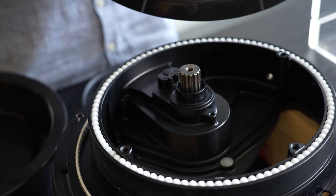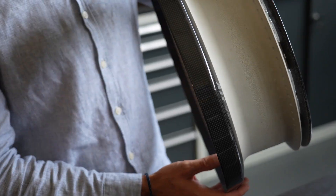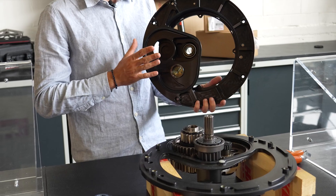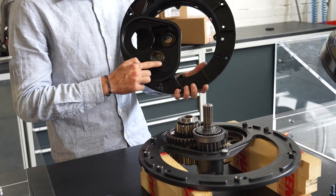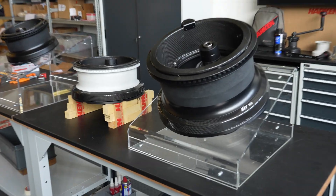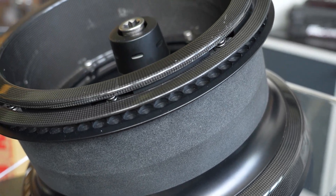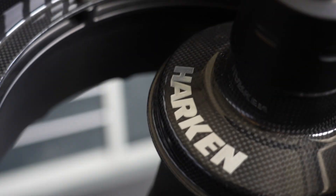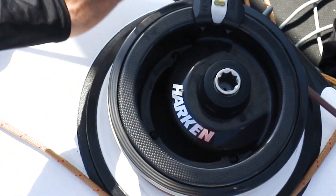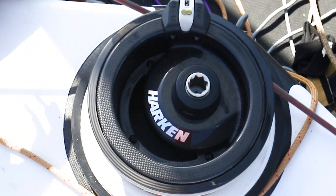Following the need to increase massively the drum diameter, usually when you do that in the design, you know that the weight of the winch will for sure increase. Instead, we added the challenge to make it exactly the opposite: increase the drum diameter and reduce weight. The only way we found to do that was basically, instead of having the typical standard configuration with a central shaft, move all the gears to the side close by the drum, and because of that, move the central shaft sideways as well. That was the solution we found in order to match the big drum diameter and also achieve weight reduction on the overall winch.